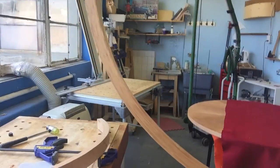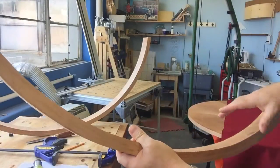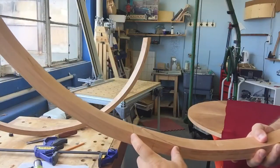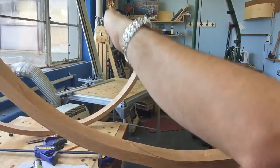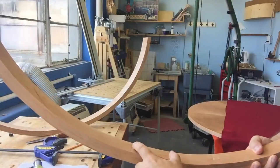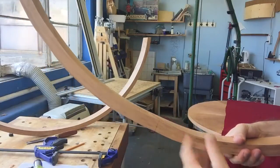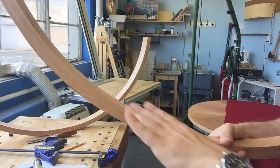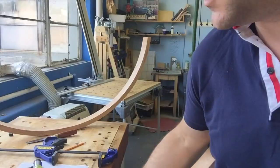So I'll cut the first half. In case you didn't watch the bent lamination video which preceded this one - when I made these bent laminations, I kept a section of about 3 to 4 inches as a flat spot. So it's not a continuous curve; it's a curve, then a flat spot, and then another curve. The reason is that flat section makes the joinery much more straightforward when I come to cut for the half lap. And of course, it's not noticeable to the eye.